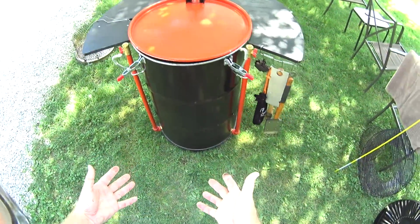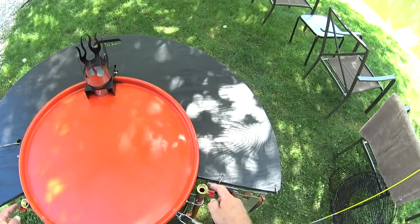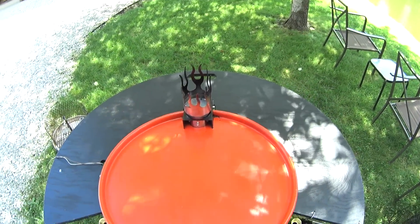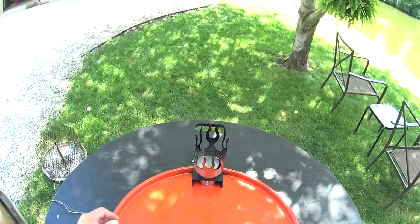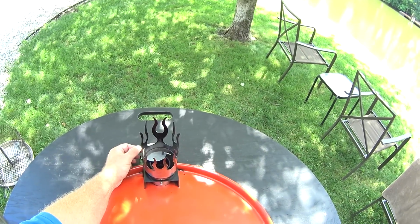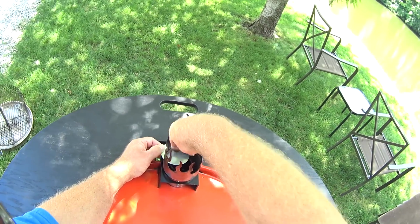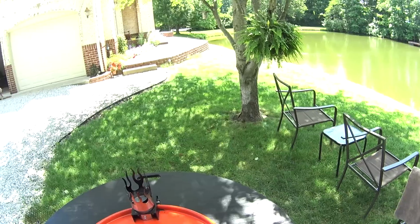My opinion now, afterwards, is you could probably do away with this stuff. Once you get your airflow set at the bottom, you don't need these. These ball valves are kind of expensive. It's just another cost that you don't need. Use the big vent on the bottom, get it adjusted, tweak it where you want it. And I adjust the temperature by letting out more or less air.